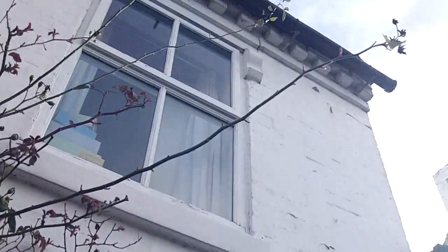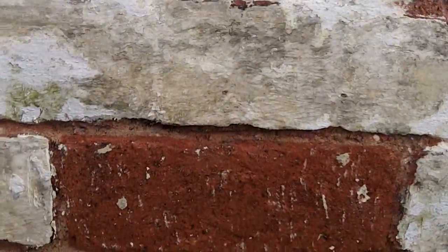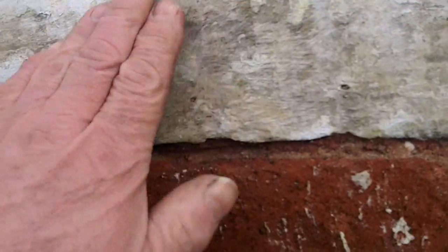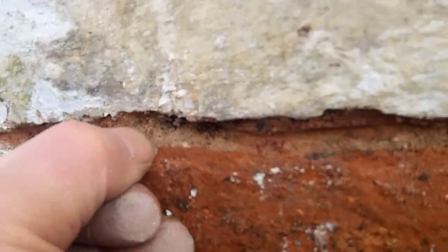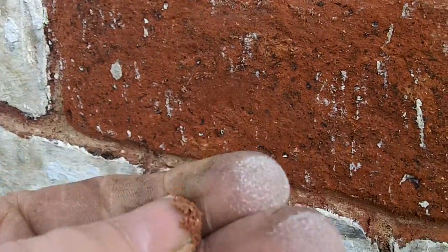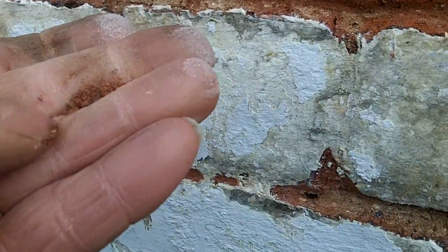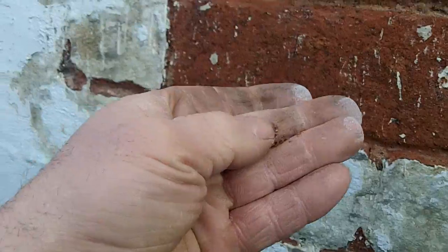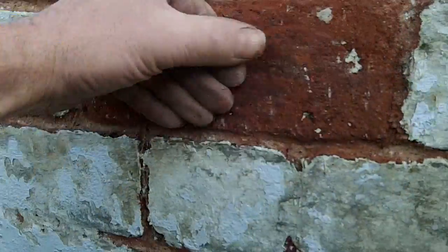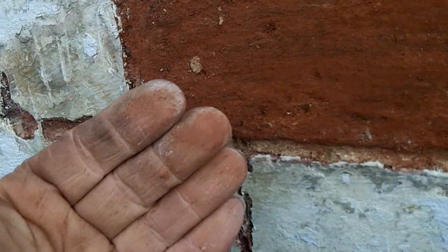This is the cold outside corner — this is where it's particularly wet. What we've done is actually taken off the plastic paint and exposed this Victorian limewash underneath. And this — if you can see — is the actual mortar. If I run my finger along that, I can pull that mortar off, and it is physically wet. That's lime mortar, but it is physically wet, and it is so wet that the brickwork — the wall of the house — is actually wet. You can see it on my fingers; it's water.